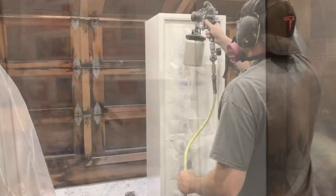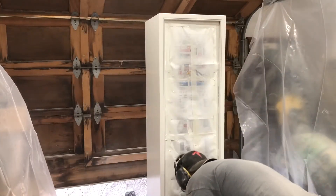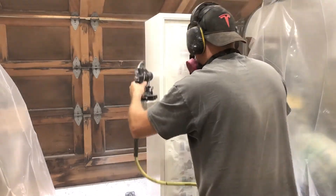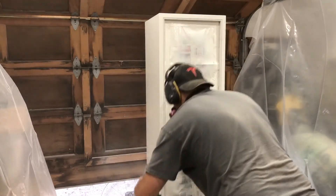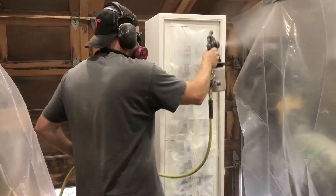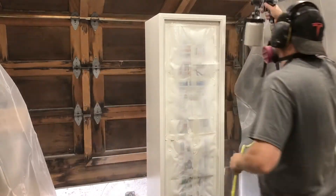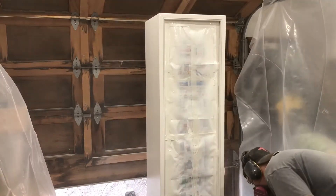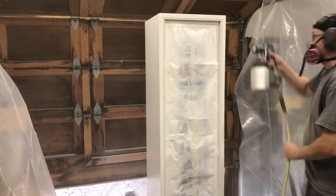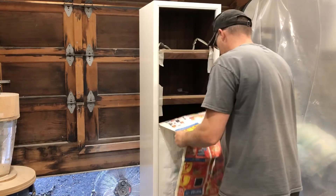The second coat is much, much nicer — the difference between first and second coat is night and day. This is the first coat of the top coat: CC40, or Cloud Cover 40, at a 20-degree sheen — a lacquer-based product. This doesn't dry as fast as the primer; I give it about an hour between coats, but you don't have to sand. After two coats of that, it's like magic time.